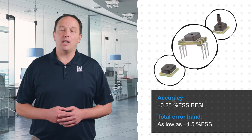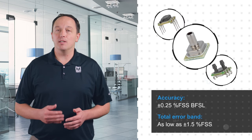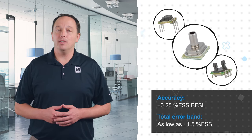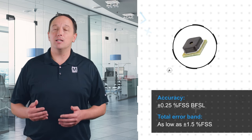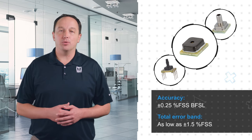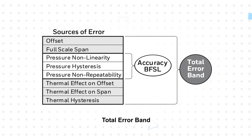The sensors offer ratiometric analog or digital outputs for easy integration. They're fully calibrated and temperature compensated for sensor offset, sensitivity, temperature effects, and non-linearity using an onboard ASIC, providing high accuracy and a tight total error band. Total error band is a specification that accounts for additional sources of error beyond the standard accuracy spec and provides a more comprehensive measurement of the sensor's true accuracy.